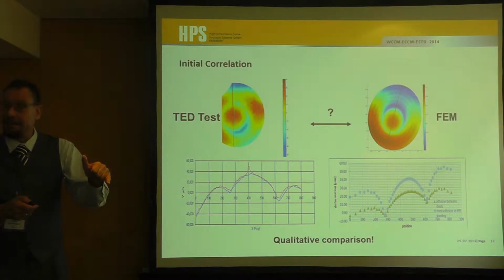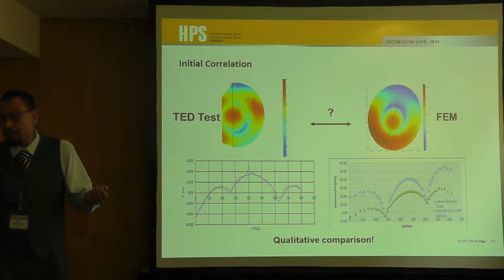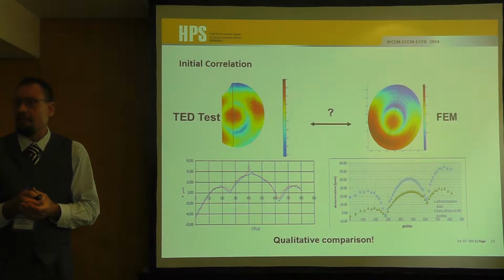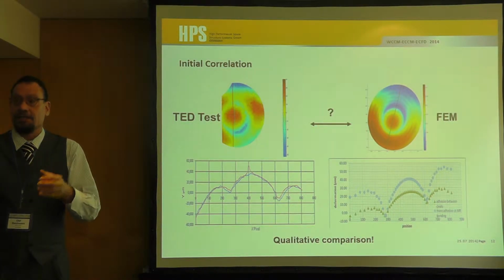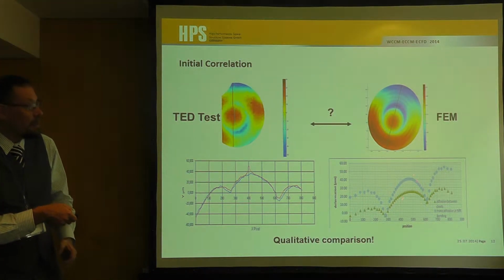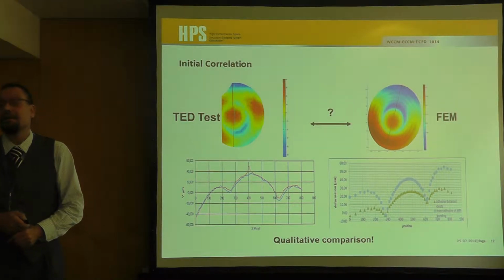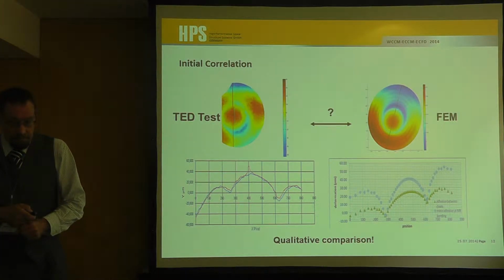such as different CTEs. And in the model, for example, the thickness of your bonding film is usually always the same. In reality, if you have those curved surfaces, it may change a little. You can see in these two pictures just a little change in the bonding thickness, which is more or less inside the manufacturing tolerance.